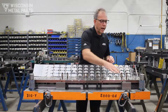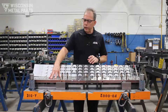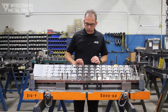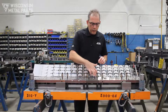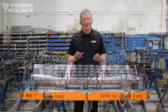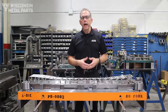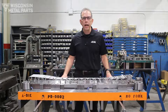We also have our die stops — top and bottom — and remember how we use those when the die comes closed: that's what times out the die and puts everything else in sequence. On this tool for the forming it's especially important, because the height of your forms, the thickness of your material, and the height of your lower die blocks all have to come together to form and achieve the tight radii you're after. Thanks for joining us today — I hope you learned a little more about the pros and cons of a multi-out progressive stamping tool. Don't forget to subscribe to our channel, and if you need help on your next project, Wisconsin Metal Parts welcomes challenges — our people serve with purpose, pride, and passion.